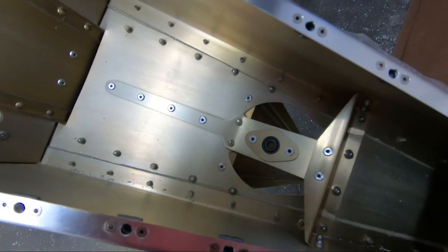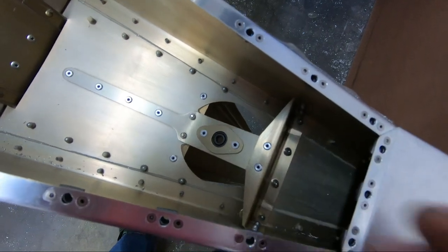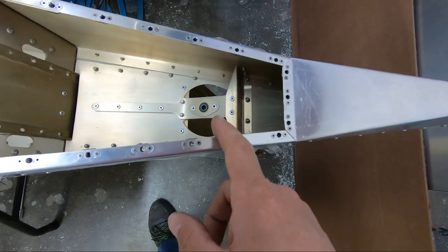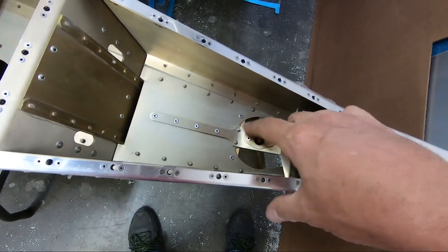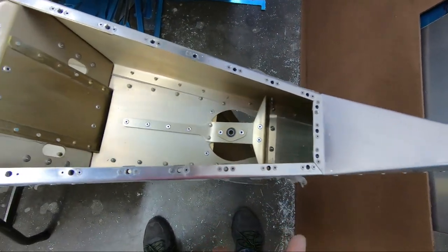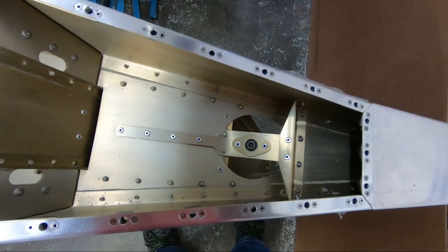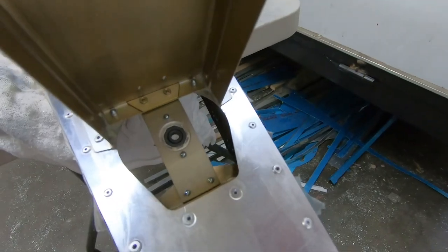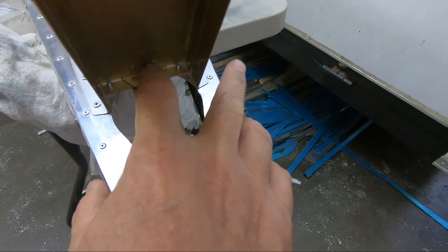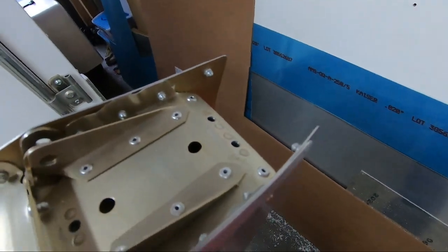You can see the two number 4 bolts that I put in the bottom of the rear spar for the vertical fin that attaches this lower mount for the rudder. I've pretty much got everything done in here now. I'm going to flip it over and see if I can start fitting the rudder into place, making sure there's no interference fit between this opening and the bottom of the rudder, and also do some fitting at the top. There's no reason right now that I can't get the rudder permanently attached — with a bolt on the bottom and bolts on the top, there's no reason it should have to come off again.